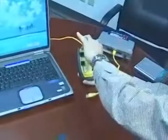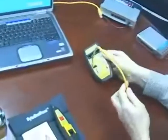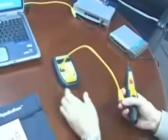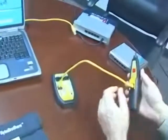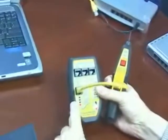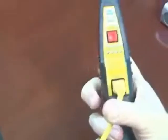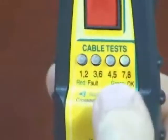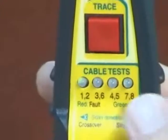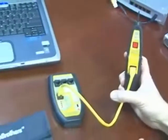The last feature I'd like to show you is the cable test ability. Let's use the cable test socket to test the jumper cable itself. You get a probe with the TBR-1000 — you can use it like any other probe to locate the cable. Once you locate the cable, simply plug it in. So if you're in a remote wiring closet, you can locate it and then immediately plug it in. The main unit will continue to strobe the pairs 1-2-3-6-4-5-7-8 continuously, and on the remote probe, it likewise shows 1-2-3-6-4-5-7-8. The label tells you that if it's going left to right, it's a straight-through cable; if it was going right to left, it is a crossover cable. If the LEDs are all green, the cable is okay; if the LEDs go red, you have a fault in the cable.